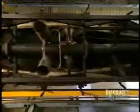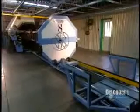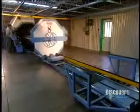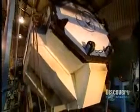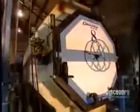The oven is 23 feet long and has a diameter of about 6 feet. The polyethylene melts at 550 degrees. To completely distribute the powder throughout the mold, it pivots on several axes. It turns on itself while the oven oscillates 30 degrees toward the front and rear. This procedure is termed rock and roll and lasts 19 minutes.